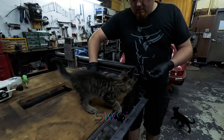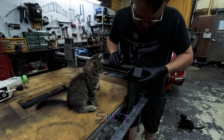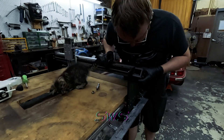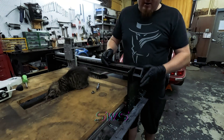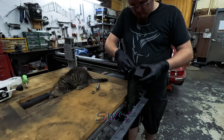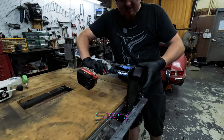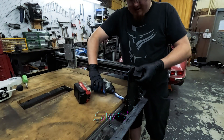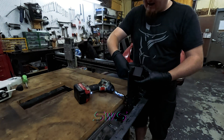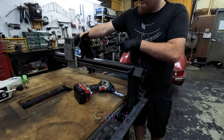Now we're going to put our motor mounts on here. If I position it this way it'll be easy to tighten the coupler but it'll look funny — whatever. I'll put the coupler on and then slide this rail all the way to one side, use that to gauge where this needs to sit, tighten it, and then repeat the process on the other end.